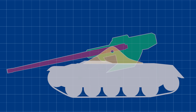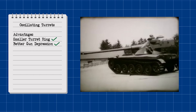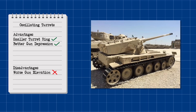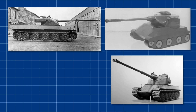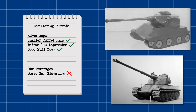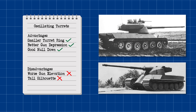In terms of gun depression and elevation though, these vehicles do have a disadvantage. The breech may not hit the turret ring, but the rear of the turret itself can hit the engine deck when elevating the gun. You can see this clearly on the AMX-13 — the gun can't actually elevate all that much because the turret bustle would strike the rear of the hull. To combat this and maximise elevation and depression, oscillating turrets try to mount the gun as high as possible in the upper turret. This means the vehicle can peek over obstacles and expose very little of the turret, but it also means oscillating turrets tend to be quite tall, like you can see on the AMX-50.